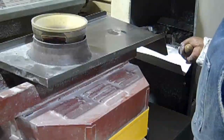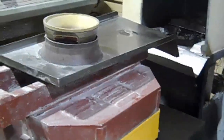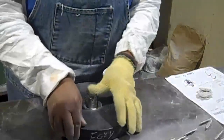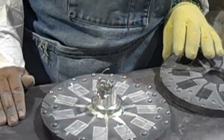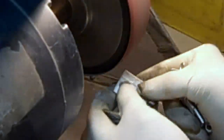Molten pewter is then poured into the mold, which spins multiple times. Through strong forces, liquid metal enters the jewelry cavities, which holds the impressions of the jewelry. After a short while, the metal solidifies. From there, we can break off the individual pieces, which are now in fact raw pieces of jewelry.